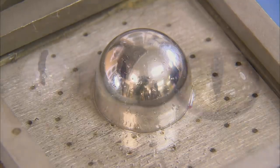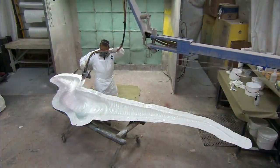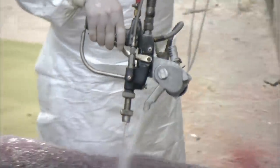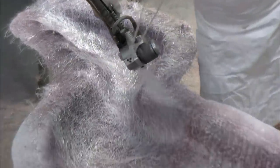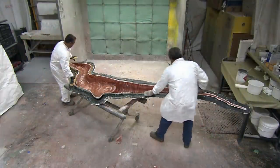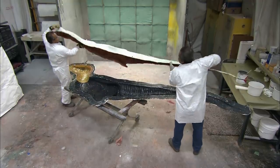Maybe these are for a do-you-think-y-saurus. A plastics technician now prepares the fibreglass mould. A chopper gun is used to cover the insides of the mould with flexible fibreglass strands, which take the shape of the mould. The strands are then brushed with resin, which bonds them together. Once the resin has cured, the hard fibreglass shell retains the shape of the initial foam sculpture.